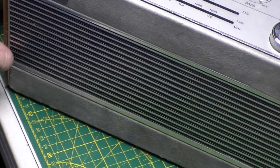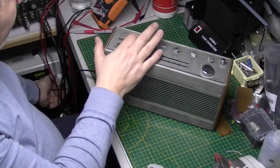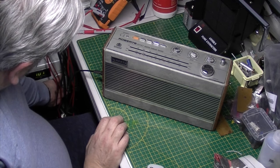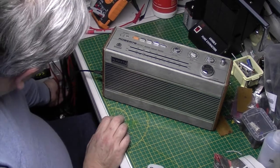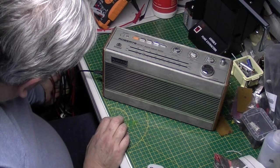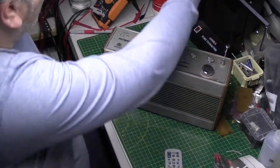So what we'll do is we'll put some power on it first and have a look, see if I can get it to do the same. So bear with me, I'll just get a figure of eight cable. Okay, I'm plugged in. Turn the power off. Actually, I'll leave the power on. Bring them up slowly, so I can have a look at the current draw on it. Volts. 150. There we go. It's just drawing 20 milliamps. Just connect the cable. Here we are.